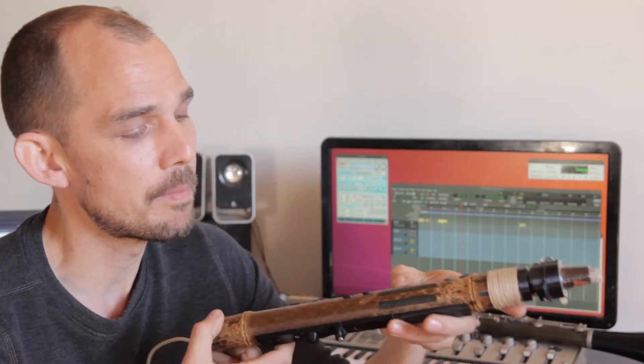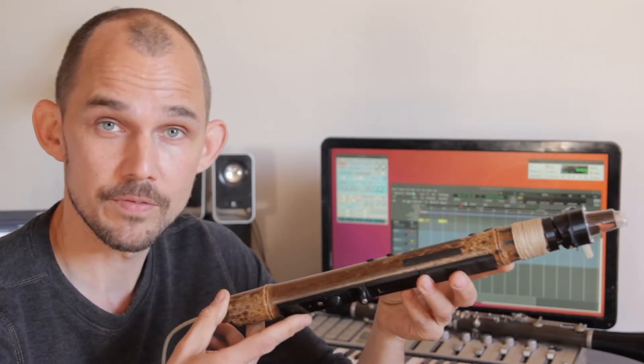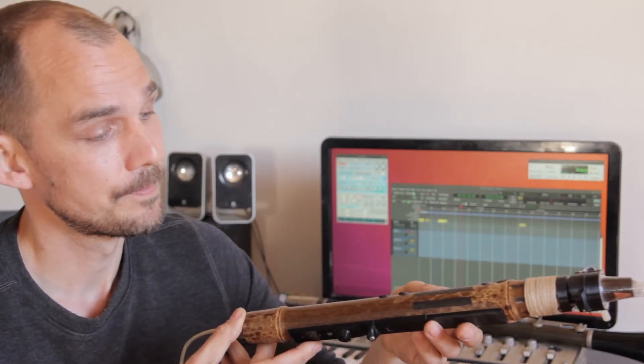The two capacitive touch sliders on the side of the instrument each consist of four capacitive sensors placed in a pattern so that the touch of a finger covers one sensor and the next one over to a varying degree, and then applying a classic slider algorithm to that to resolve an absolute position. The output from the sliders could be a customizable continuous controller, it could be an NRPN, or alternatively you can use it as an activator for one of the other sensors.